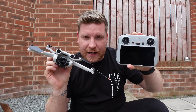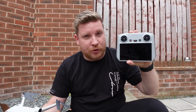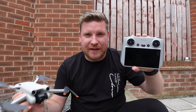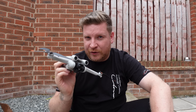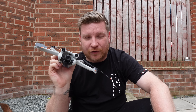I don't know whether it's algorithm-related or specific to this controller and drone combination, but it could well be that the DJI RC is picking the wrong connection for your flying environment. This works both ways — it could be putting you on 2.4GHz in a built-up area when 5.8GHz would be better, or running on 5.8GHz in a rural area when it should be on 2.4GHz. So what I'd suggest is: next time you're flying and getting a poor connection, flick into the settings and the transmission tab, and make sure you're running on the right frequency for your environment. This is possibly something DJI could fix in a firmware update, but it's certainly something I've observed that may explain most of the discrepancies as to why some people have range problems and others don't.